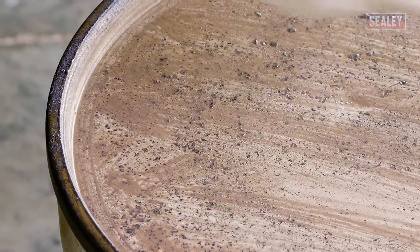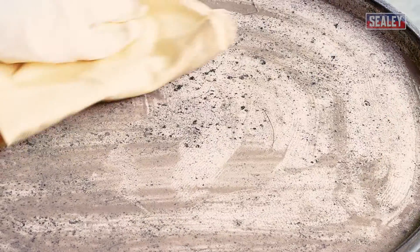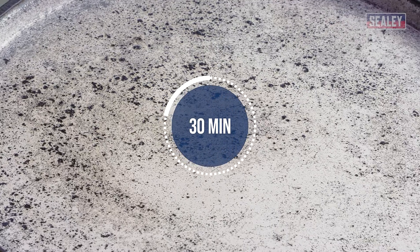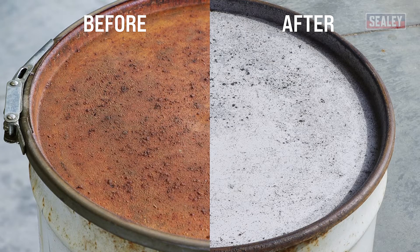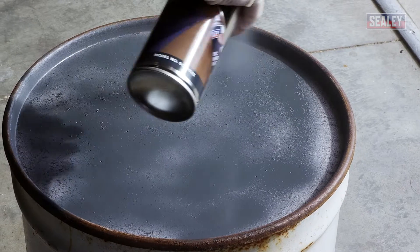You should continue the application until a dark grey surface has formed. Then brush on a final thin coat of rust remover and wipe dry immediately with a clean lint-free cloth. Leave the surface to dry for around 30 minutes. Now apply a primer to prevent further corrosion and to prepare the area for further finishes.